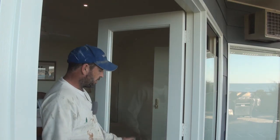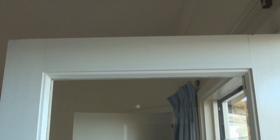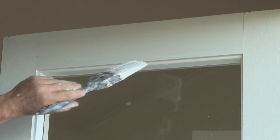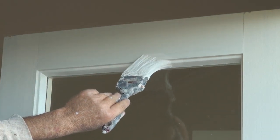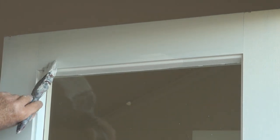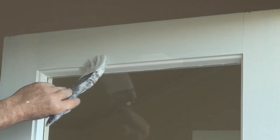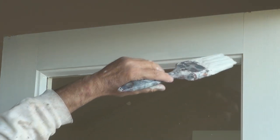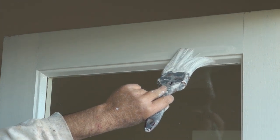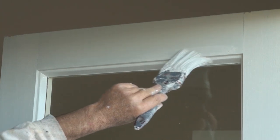Now when you're painting a glass panel door, the first thing you want to do is top, followed by the centre, followed by the bottom, and then you paint both your sides. Now always paint the beading by the glass first, and every time you paint your beading, make sure you take paint just under the glass slightly. You want to make sure you actually create a seal there, so moisture doesn't get in.